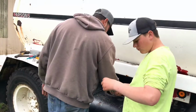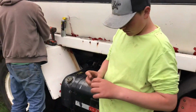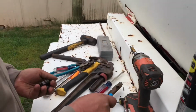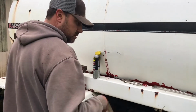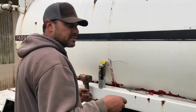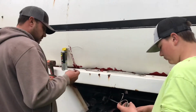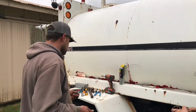Cloudy day. We could probably seal this cap up. So it looks like we're gonna have to pull her off. We'll pull it off, put a bunch of old bolts and washers and stuff in there, put some diesel, slosh it all around, break up that rust, and then dump it out. We could use that stuff to start burn piles or whatever, rust piles.